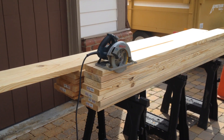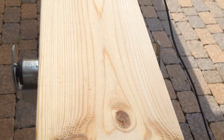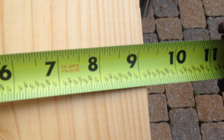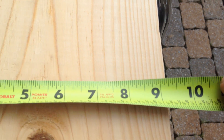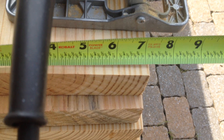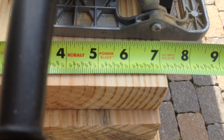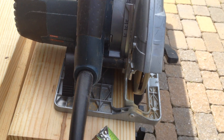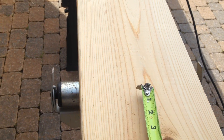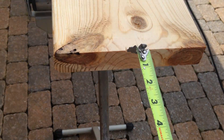So here's the deal with the box framing. These are two different sizes. These are 9 inches — 9 and a smidgen. And then these are 7 and an eighth, or almost 7 and a quarter. But these have to be ripped. These 9-inch ones can stay the same width — I don't have to rip these because the post is a 6 by 6.